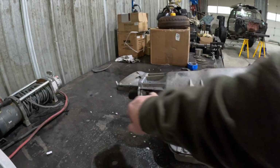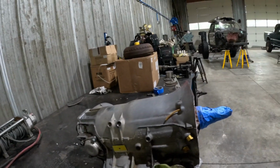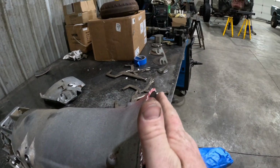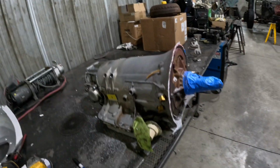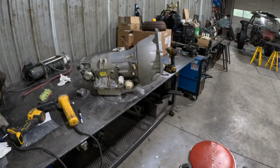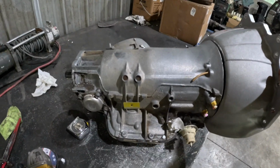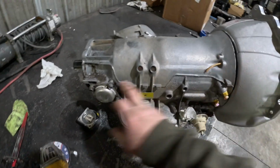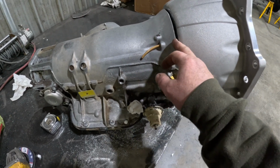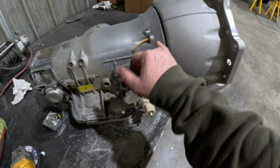Go on a 400, the 17 3/4 from the back of the case. So probably make some marks around it. It's pretty self-explanatory. It's just going to come right up to this edge of this pump face. So pretty much you can just kind of eyeball it around. Super Bell. Okay, she's on. I don't get their instructions. It says 17 3/4 from the rear of the case to the front. This is like 17 and 7/8, and there's still a huge gap.